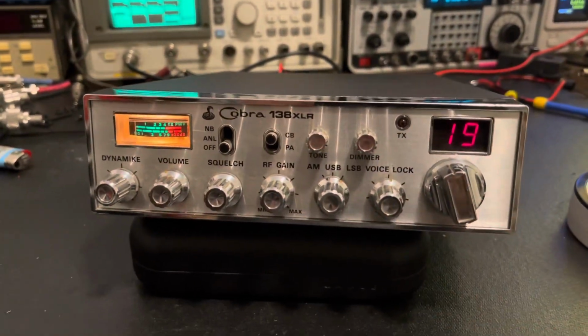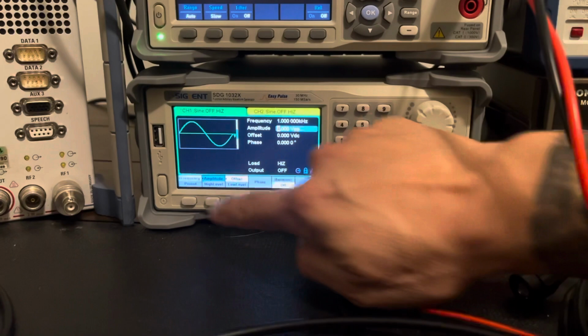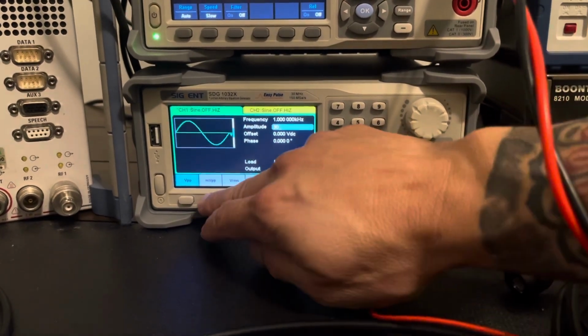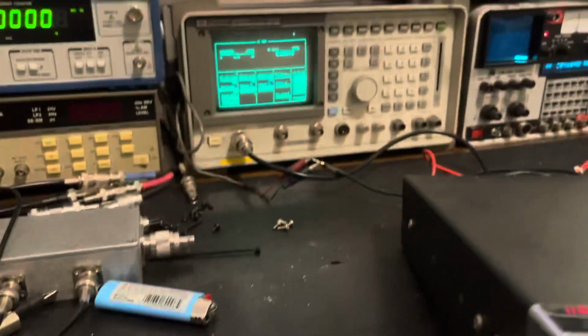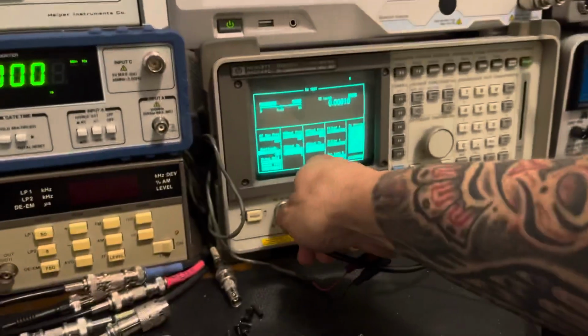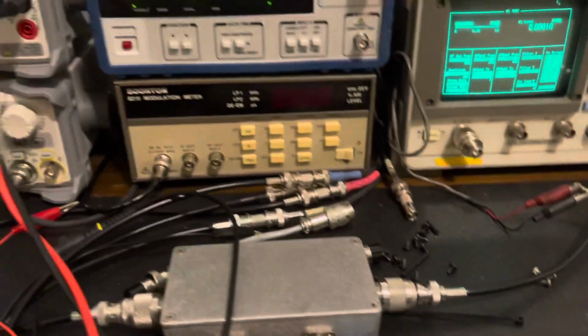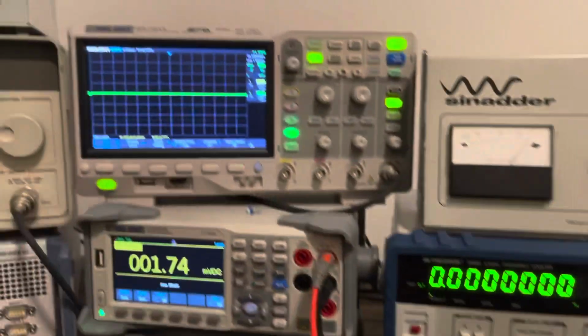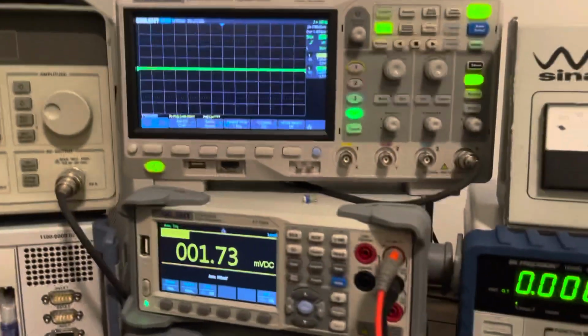It really is. Okay, so let's set this up for just a 1 kilohertz tone. And let's stick a mic into her here. We'll put her on AM, and we'll stick her into our RF sampler, and we're gonna look at just her waveform module. Well, yeah, we'll look at her. Let's look at her power too. We'll put that over to 5-watt scale.